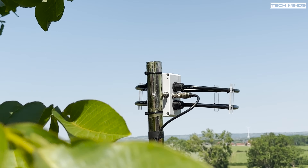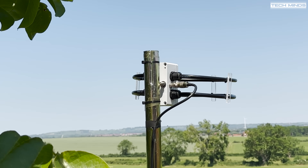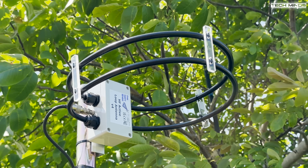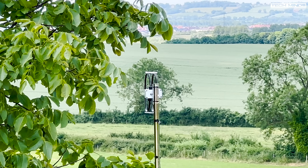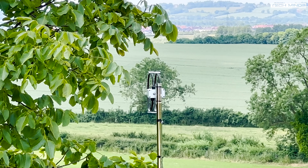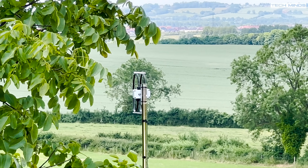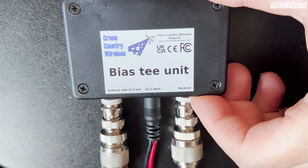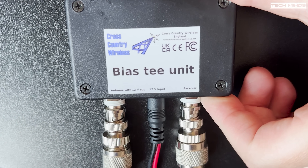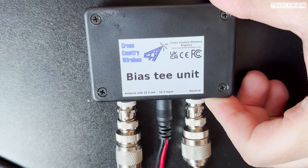It's not particularly high for horizontal polarization — I believe if installing the antenna horizontally it should be at least one quarter wave above the ground. Maybe I'll get this installed on my main mast above the roof line in the near future. When you mount the antenna vertically it can be low to the ground, but you do get some nulls on the sides, just like you do with any magnetic loop. With the feeder cable plugged into the bias-T unit and then off to the RSP-DX SDR receiver, I turned on the power supply to feed the 12 volts to the bias-T.